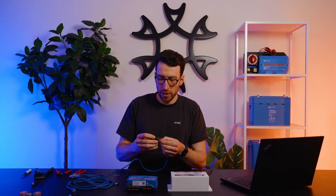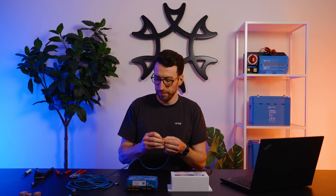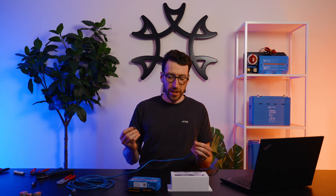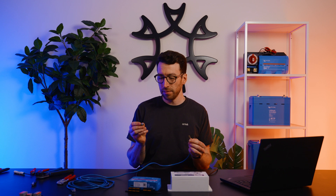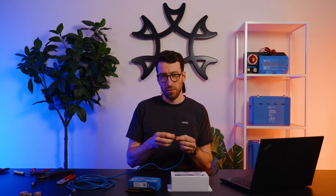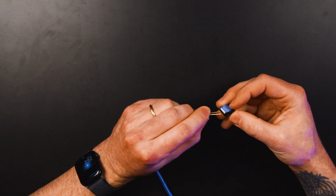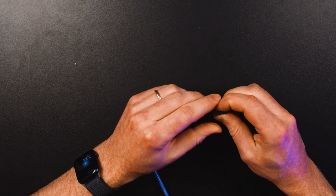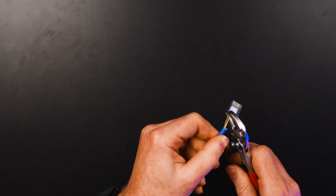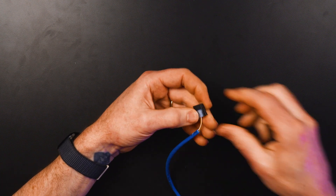This pair of cables represents CAN high and CAN low. The white with orange stripe is CAN high and the solid orange is CAN low. Straighten these cables out. When inserting the CAN high and CAN low cables into the four-pin male connector, you'll notice four slots — we're going to use the two middle ones. For the CAN high cable, the white one, insert it in the slot closest to the release tab, and the CAN low goes into the slot next to it. Then take a pair of pliers and close the clamp, creating the cable.